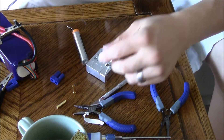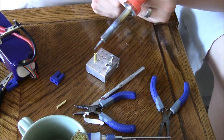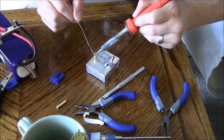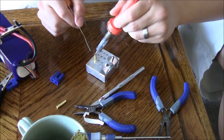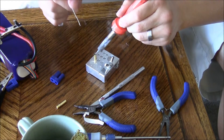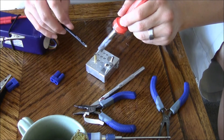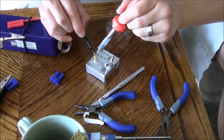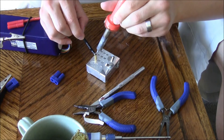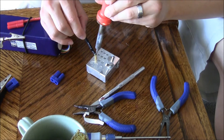Now we're going to take our jig and put our EC5 connector in there. We're going to put some solder in here — you don't need a lot because you already have a lot of solder on the battery connection. Just put a little bit in to coat the sides and make sure the cup in here is nice and hot. Take your battery wire — be careful because it could still be really hot — and put it right there. Once the solder on the battery connection starts to liquefy, start pushing it in while sliding your solder out.